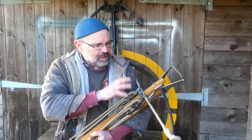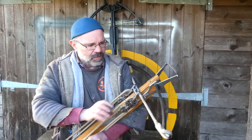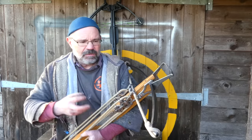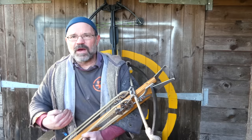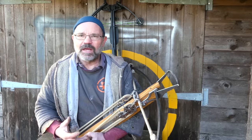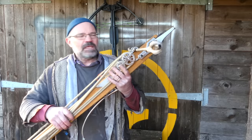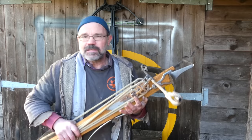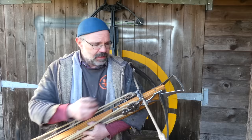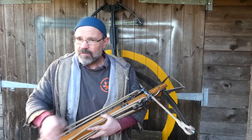Compared to modern materials, it sounds like I'm dissing this bow — but this is state of the art for 1400. The string itself has to be thick to take 960 pounds of load, and it's natural fiber, so a thick cord here is heavy. Again, you're putting the work of the bow into accelerating the whole mechanism, not the bolt — and that's what you want to accelerate. Yes it's a very high draw weight, but it's not the headline number that matters. 960 pounds — people think it's going to shoot through walls, through tanks — no it doesn't, because the efficiency is low, the draw length is low, and all the mass in this entire system is very high; it doesn't want to move. So overall these machines are really powerful, but not remotely as efficient as a modern bow.